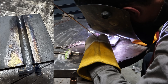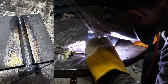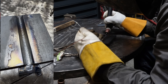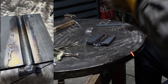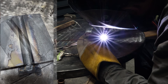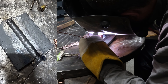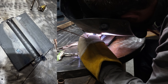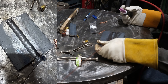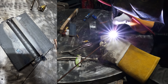I need to do more strength tests and cutting etches on TIG welds to give an overview compared to other processes. The weld isn't really that much stronger than MIG or stick on tensile strength and charpy tests. However, the ability to maintain 100% fusion — no lack of fusion, no porosity, basically clean perfect welds — is where the strength of TIG comes from. It's not really the filler; it's how that filler is put down.